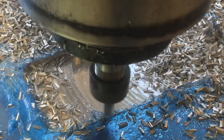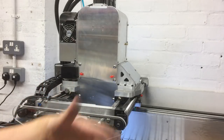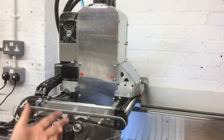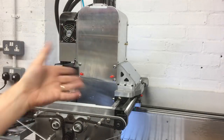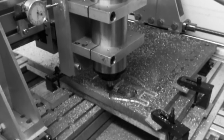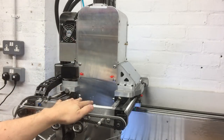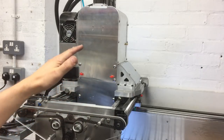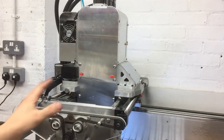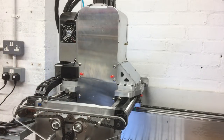This design suits my needs well, but it might not be the machine for you. There's a lot of parts and complexity here, and you can get away with a lot less. You could just have a beam router and that will machine wood all day long and occasional aluminium too. I bootstrapped my way up from simpler machines to build this. But if you want to machine a lot of aluminium, you do need some stiffness. Before you embark on this, make sure it's definitely the machine for you and that you can't get away with something simpler, quicker to build, and cheaper.